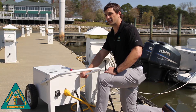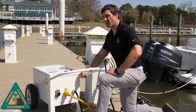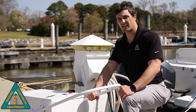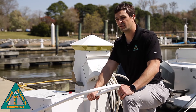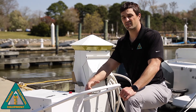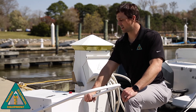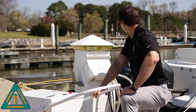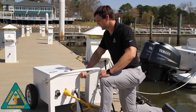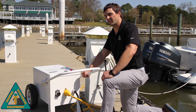Any reading you find on this indicates a problem with the wiring on the boat — take note of this reading. Now we're going to move on to the next circuit, for example a water heater or an air conditioner. We'll go on the boat and energize that circuit breaker and actually load it. The key is to load each circuit — so in the example of a water heater, you turn the circuit breaker on and make sure that water heater is calling for hot water. Then monitor the display. In this case, the water heater is leaking 20 milliamps. Take note of this reading, de-energize that circuit, and move on to the next circuit.